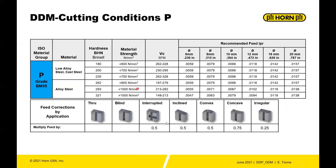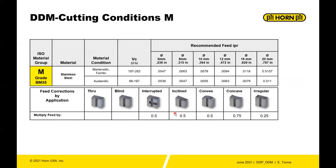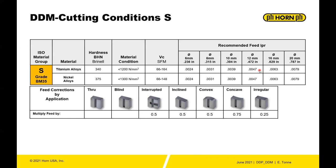For stainless steel with the DDM, austenitic stainless tends to be very sticky, so pay close attention to cutting speed — make sure you have enough speed to begin softening the material as you cut and avoid built-up edge. Also monitor your feed rates carefully.